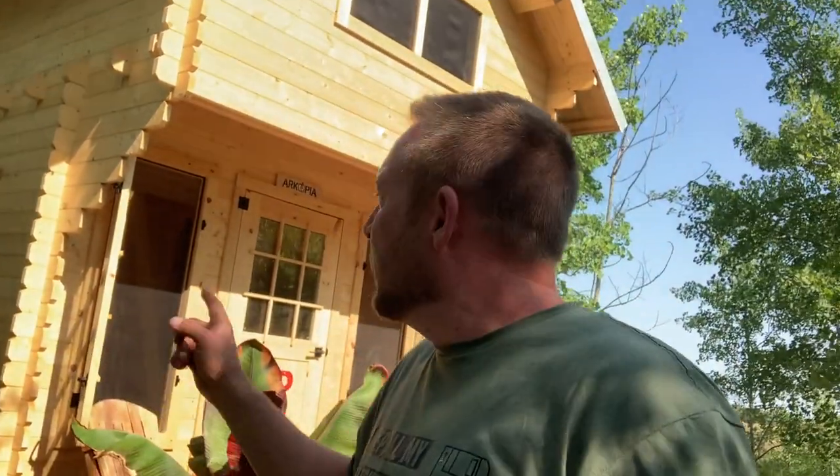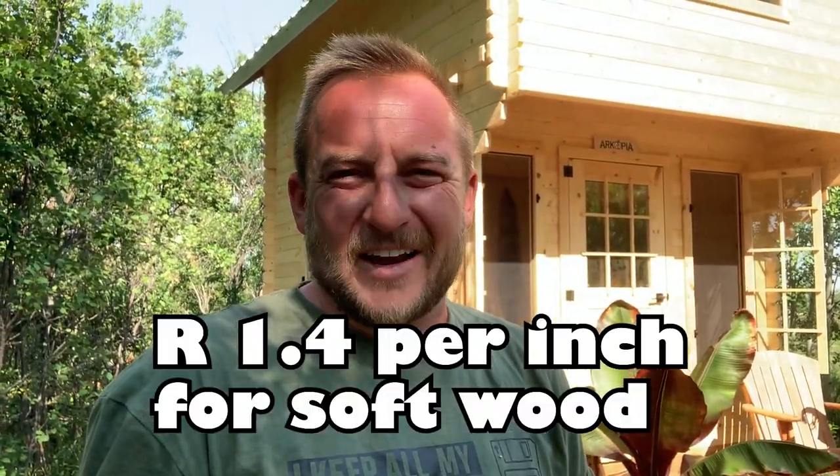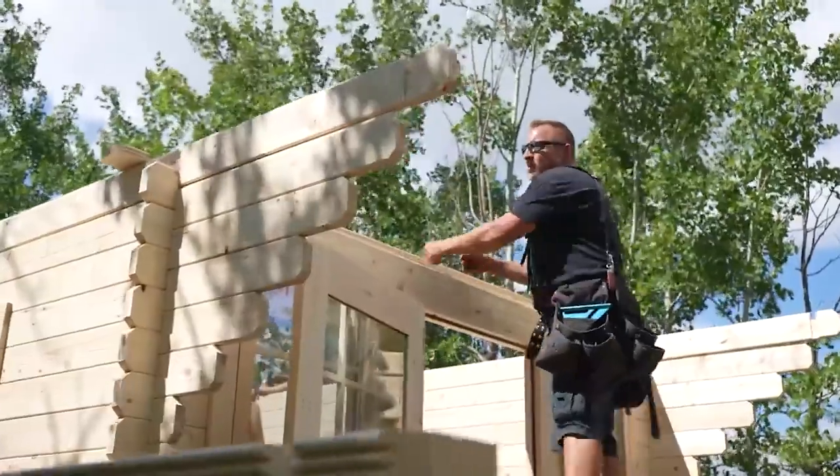The windows it comes with are not super high performance doors and windows — I think they build them themselves with the kit. There's not really any point doing too much insulation. The purpose of a Bunky Life thing is to have a finished outside and inside — a log cabin feel. If you're going to insulate it with rigid insulation inside or outside, it kind of defeats the purpose. Wood does have an R-value of about R1.4 per inch for spruce, so on dimensional lumber the walls are actually about an R2. After it settles, I'm going to stain it and caulk all the joints, so it is kind of sealed up that way.